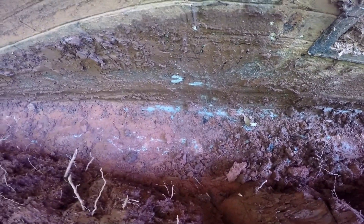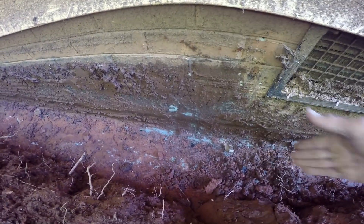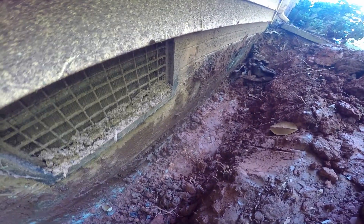The discharge is going to be out and around behind that garage — this is discharged to daylight. These guys have excavated down to the footer, and you can see where I just exposed a little bit of that solid concrete from the footer. Basically we're going to clean off this wall and the footer, all the way from where we started here in the corner all the way around to where it will discharge.